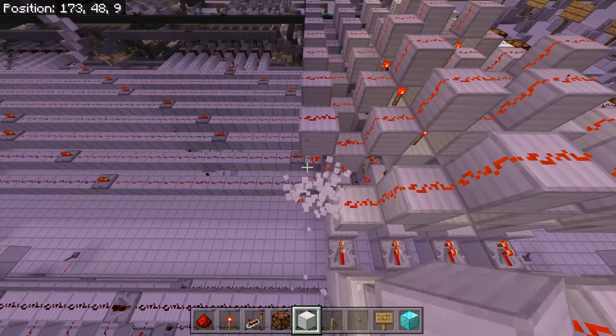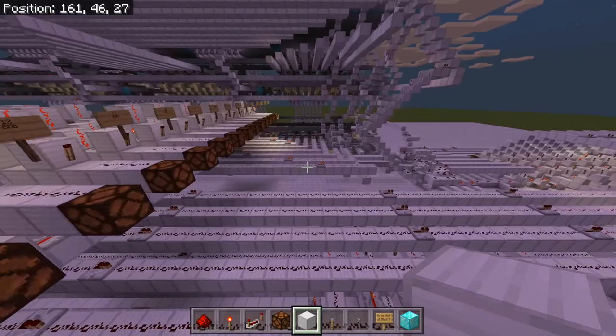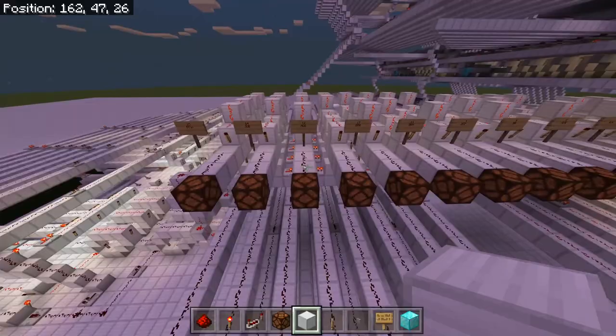It's quite similar to some of his other architectures, like the original InMOS transputer and subsequently the XMOS processor and various others. This, particularly the prefix instruction here, is kind of a standard thing in his architectures. Not that other architectures don't have prefix instructions, it's just the style of doing it for the operand register and everything is kind of his way of designing things, and it works really well.